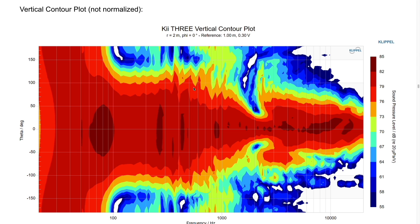The directivity index would be perfectly smooth if it weren't for the vertical orientation — and sometimes in designs, that's just what you have to give up. Coaxial speakers do a great job of not really having a vertical sweet spot. Around two to three kilohertz, you start to have a bit of a suck-out, meaning as you go above or below the axis of measurement — between the tweeter and midrange — maybe about 10 to 20 degrees, you start to experience some lobing. This really isn't atypical of a two-way front design, and as long as you are on that vertical plane, you should be okay.